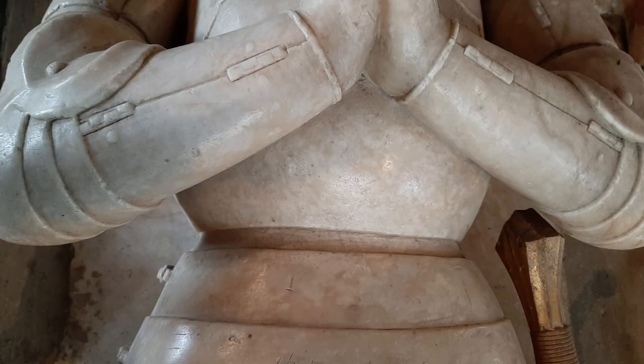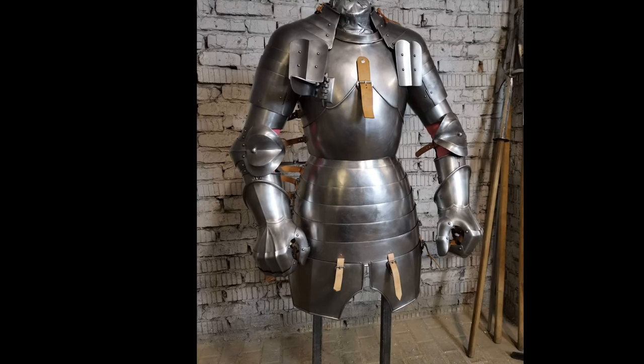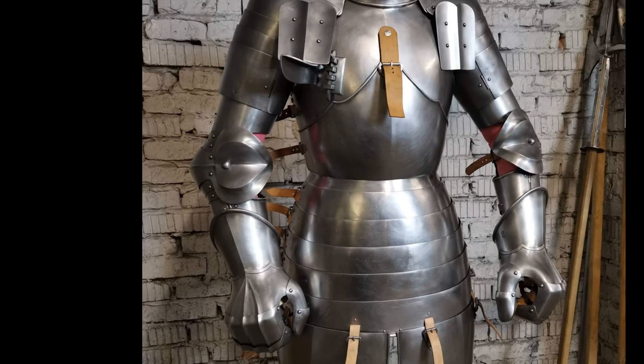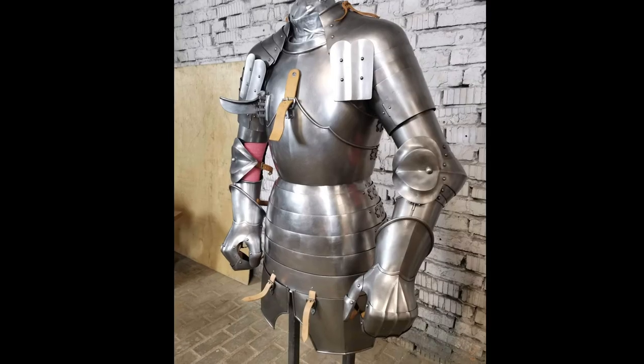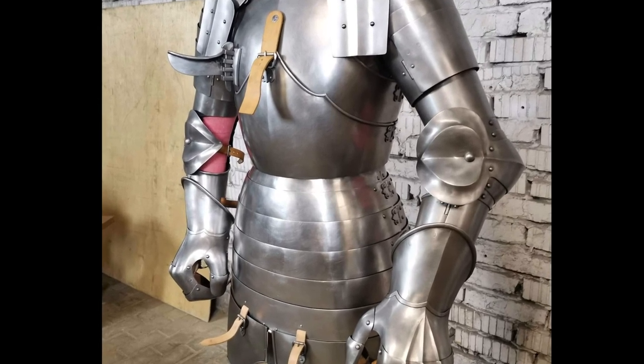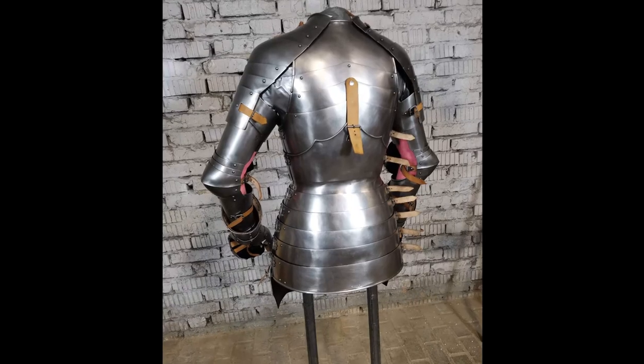Unfortunately, there are no examples of English armour surviving, so we've got no idea how they actually kept the two halves together. In this instance, we've gone for a tight fit of the fold inside the bottom of the placard, and that is to give some movement and rotation in the top half. This wasn't a problem when it was being made at Art of Steel because they had a plaster cast of my body. I am not a plaster cast and I am somewhat squidgier, and so that allows the fold to get smaller than the lower circumference of the breastplate.